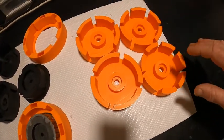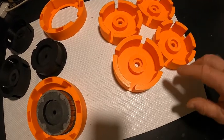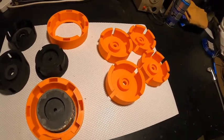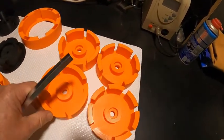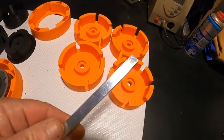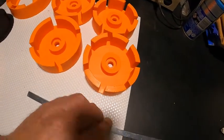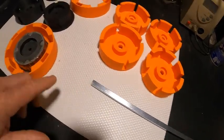We have to get it down so there's only about half a millimeter gap each side of our stator-rotor. That is pretty much where we're at at the moment. We've got various rotors to try. For our rotor we're going to be using key steel, because it doesn't retain magnetism.